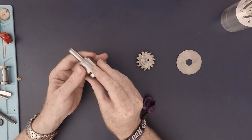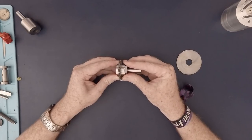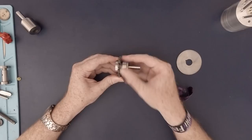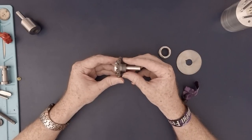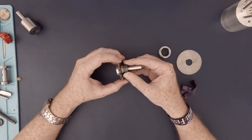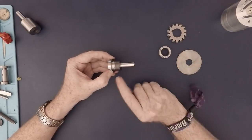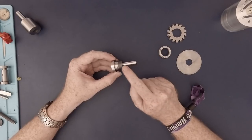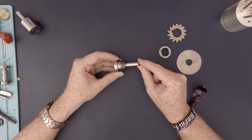To get around that limitation, this design works the other way around. The nut is on the machine side rather than the end side, and the end cap actually forms part of the main body. The register is here, and because it's on the same side of the part as the spindle diameter, it's possible to machine both surfaces in the same setup.